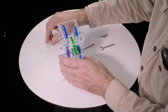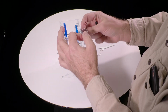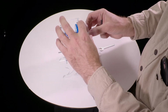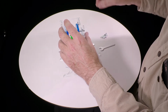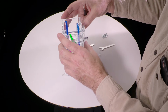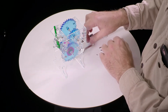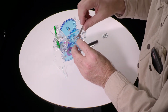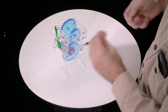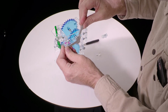very close to done. So next we attach the wrench and or the crank. If you got the electrified version, you're watching the wrong video, because we're going to have a separate video that shows how to put together the electrified version, and you won't have a crank. Put this on. We want to get this crank pretty much as far out as it can go, so just flush with the end of the screw and then back up the nut inside. Wrench. Get those two tight.